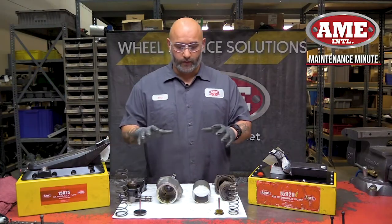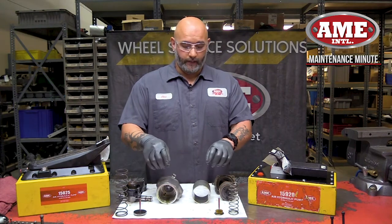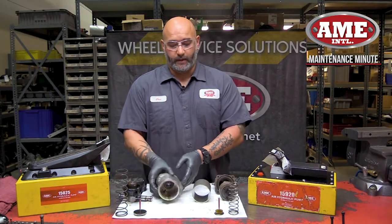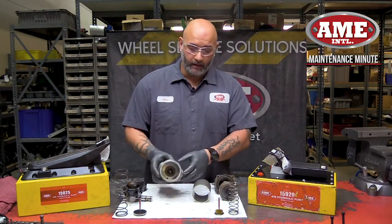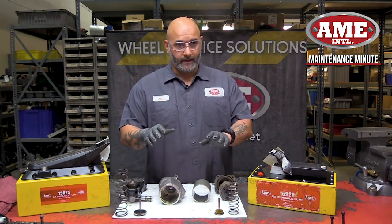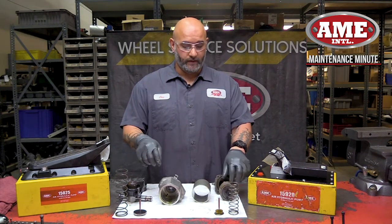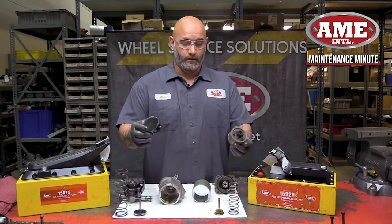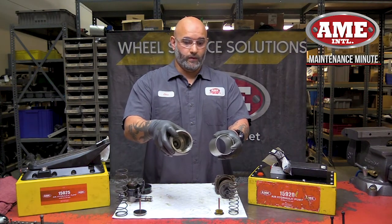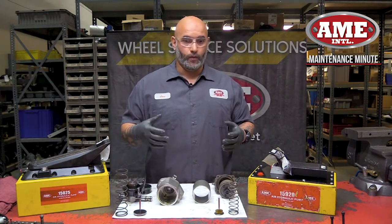The main thing that is similar between these two is your aluminum air cylinders. If you're not lubricating your air motors, you're going to tear these up on the inside and they'll need to be replaced. The hydraulic side rarely goes bad — I'd say probably eight times out of ten it is because these air motors fail. Your piston gets full of dirt and debris, chews up the cylinder walls. Once these are bad, they need to be replaced. Once you replace them, your pumps are going to function almost as new.